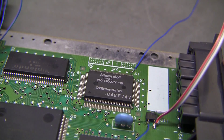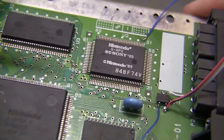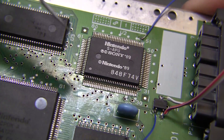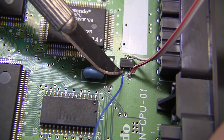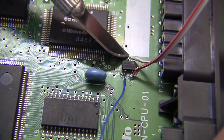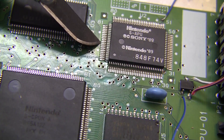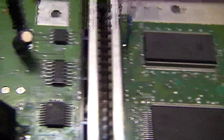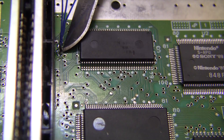Here's the S-APU chip close up. Pin 52 comes right off the chip pin to a via. Pin 16 down here goes over to that nearby chip. Power and ground are there too. You can kind of make out those three traces — that's where pins 94, 93, and 92 go off, run under the chip, and continue to the back chip where I found continuity. I traced them back and found vias right there.